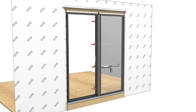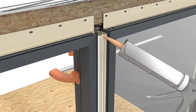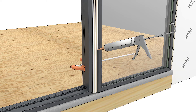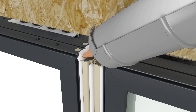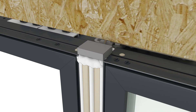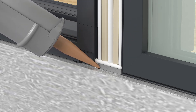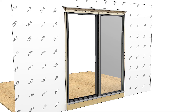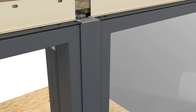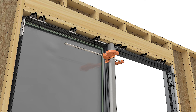On all configurations, apply three beads of sealant over the mull fillers — one on each side between the fillers and frame and one in the middle. Apply sealant on the ends of the mull filler and over the ends of the tube steel. Seat the foam blocks in the sealant at the head jamb and sill at the ends of the mull filler. Install the exterior mull cap and seat in place with a rubber mallet. Complete shimming and fastening into the rough opening at any remaining installation holes.